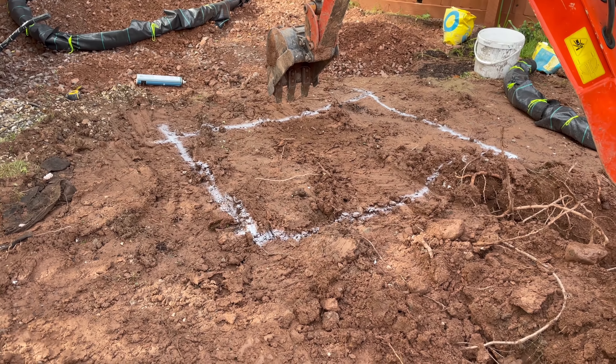I'm in a hole again — wrong type of hole! We've got a good depth and width, pretty much what we're after. We've got a load of 20mm clean stone to put in the bottom of it so it's permeable. When we put the crate in, it's got a permeable bottom so the water can still travel through. That's in position now — we'll get the 20mm stone in, check dimensions one more time, then wrap up the soak away box in the weed membrane, stick it in the hole, and connect the pipes up to it. Sun's shining — you don't want to be doing this on a wet day.